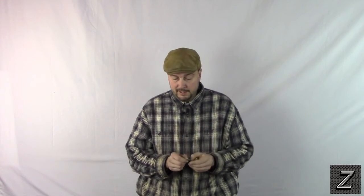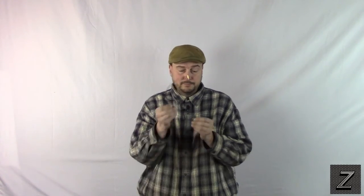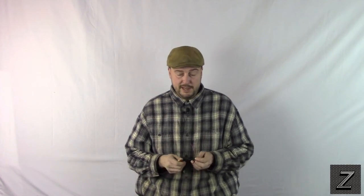You can try it yourself — if you have different results, go ahead and leave a comment. If I get a few people saying they've gotten increased range, maybe I'll come back and try it again. I did test the pigtail after hooking it up with my voltmeter on continuity to make sure all solder connections were correct and working — it just that the range wasn't there. It was actually more range with the unmodified module. So give it a try if you want, but I recommend just using them as they are. Thanks for joining us here at the Z-Hut today — hope to see you again and have a great day.